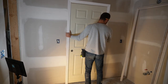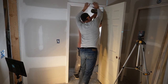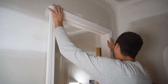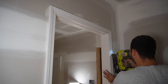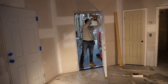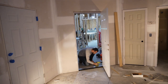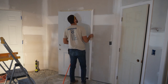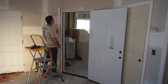The five interior doors were typical hollow-core interior doors. This apartment is only about half of my unfinished basement — the other half is my wood shop. So for soundproofing reasons, I used an exterior door which has weather stripping on all four sides including a threshold on the bottom and a solid foam core. The soundproofing also gave me different challenges: this wall has two layers of five-eighths drywall instead of a typical half-inch layer, so the door actually had to be trimmed out with casing before I could even put the trim around it.